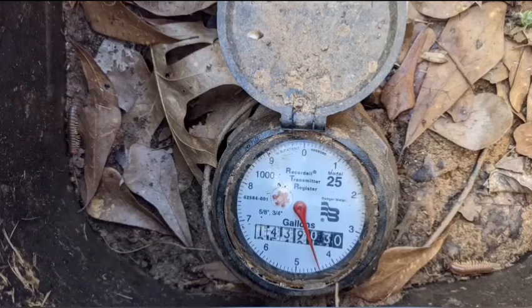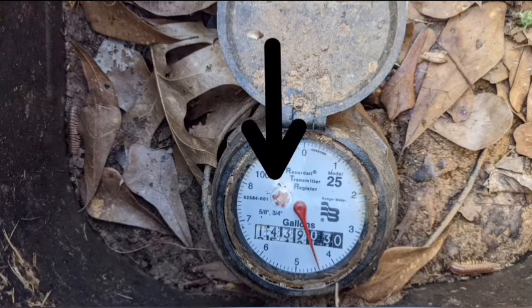You may have a leak detector on your meter, a small triangle on the meter dial. If all your water sources are off and the leak detector is rotating, you may have a leak.